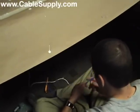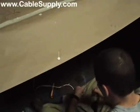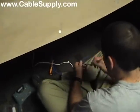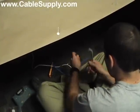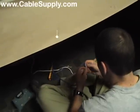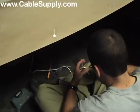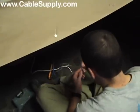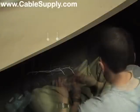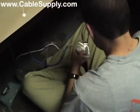Next he's going to install the computer jack. This is actually a retrofit — the building was used by another company before we came in, and we're adding the computer cable, CAT6 computer cable. This excess he's cutting off is on purpose. He's going to install this — you do not want to use a possible nick when you're stripping the cable back. Then he's going to hook up all four pairs with the computer cable.